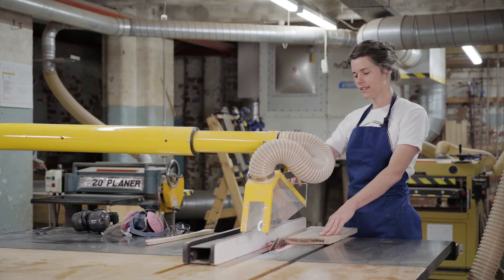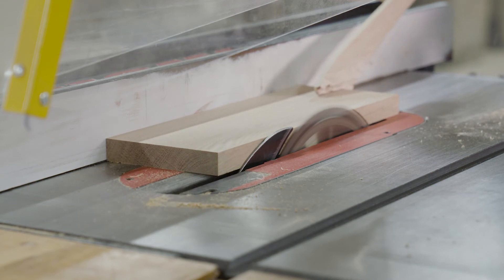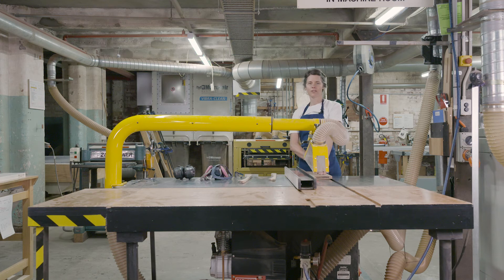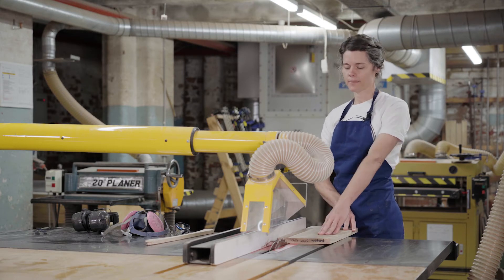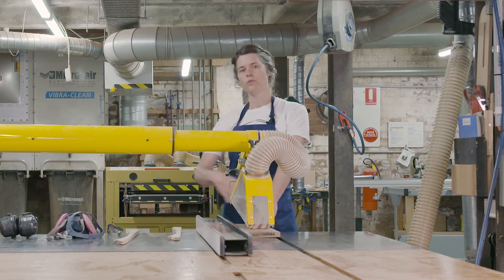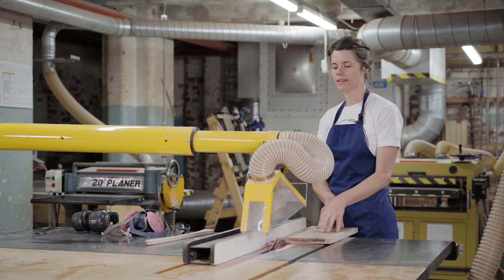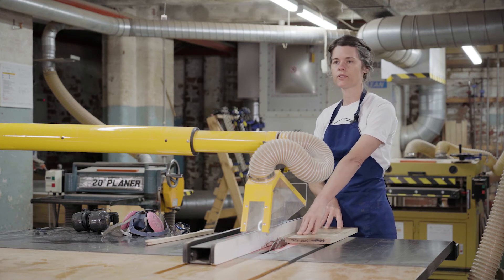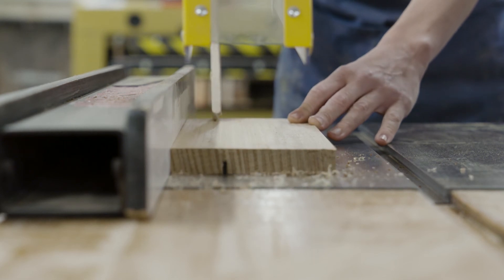Because the fence is set up closer than 150mm to the blade, use a push stick to run the piece through and avoid getting your fingers close to the spinning blade. Although you want to be exerting downward pressure and sideways pressure on your piece, make sure you are at all times avoiding leaning into the blade — should the piece disappear, you don't want your hand to fall into that spinning blade. Make sure your center of gravity is stable so you can move your arms and hands as needed while maintaining a confident stance. As you're running the piece through, make sure your hand is never at any point over the blade itself — even if you're doing a trench cut where the blade isn't cutting through the top of the board, keep your hands away from where the blade is running.